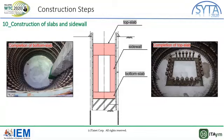In the final step, the surface of the placed concrete is cleaned and the bottom slab is constructed by setting up reinforcing steel and placing concrete, followed by the side wall and top slab. This is how the base of the bridge pier is constructed using this method.